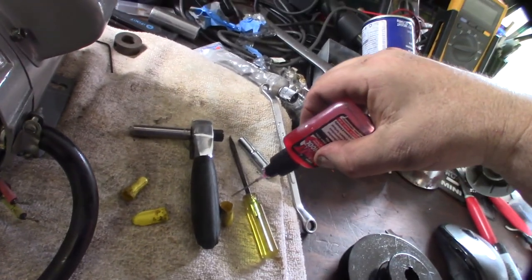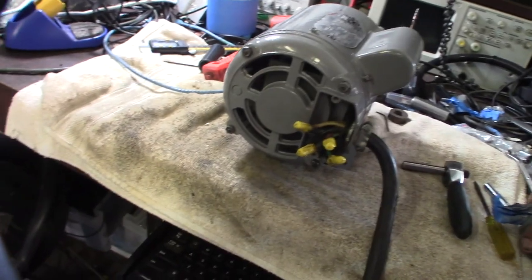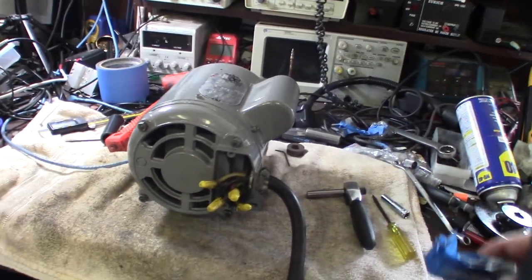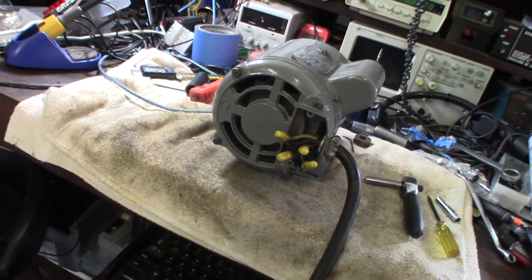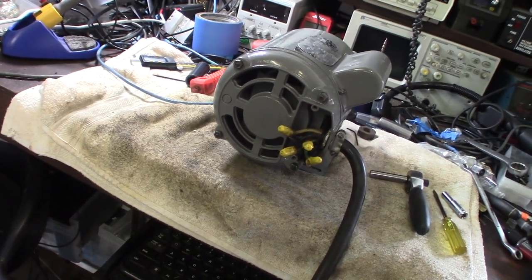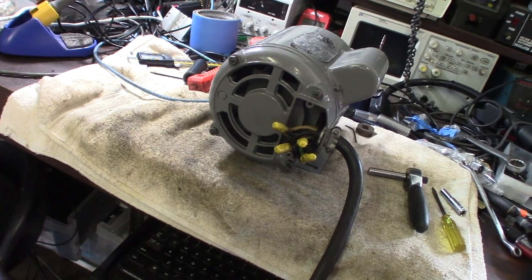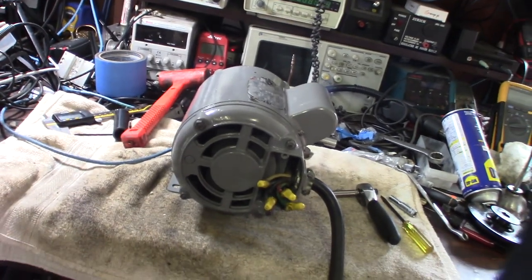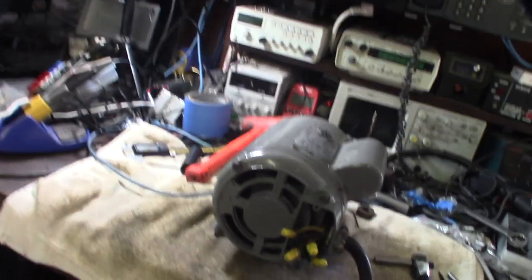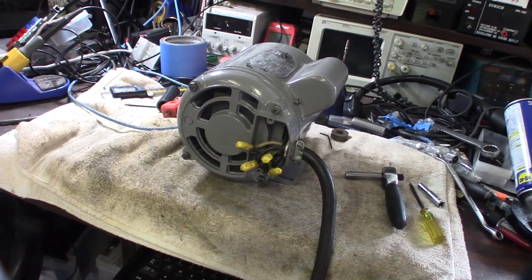As I'm putting the caps back on, I'm just putting a couple drops of Deoxit in there. Got it back together. I'm still painting the forward-reverse box — I have tape on it. Let's try forward. There's a nice pop right there on the centrifugal clutch. Reverse. This new capacitor is only slightly bigger — it's 340 to 408 microfarads, whereas the other one was 340. It's usually a 20% fluctuation. Alright, that's how you rebuild a whole Dayton motor.